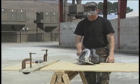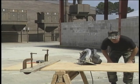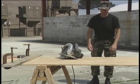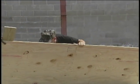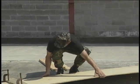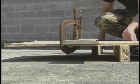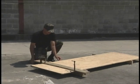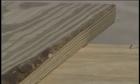Plywood and long boards sag and bend if not adequately supported. If you attempt to cut without the proper support, the blade will tend to bind and cause kickback. If the plywood or boards to be cut are too large for a table or workbench, they may be supported by 2x4s on the floor. The 2x4s should be positioned so that their broadest side supports the work and should be located close to the cut.